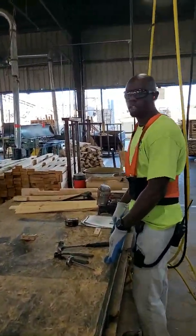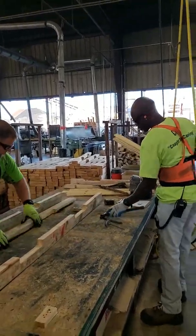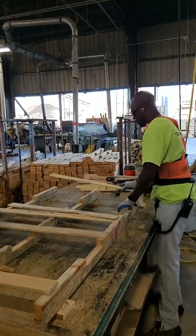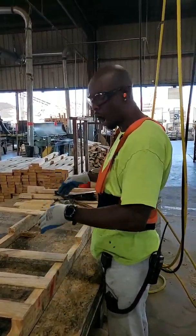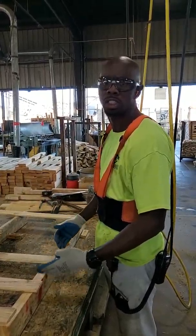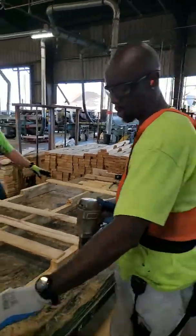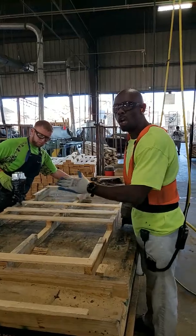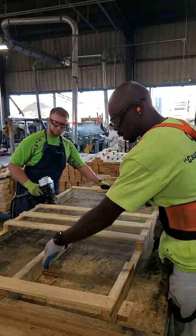Carter is grabbing three runners to start building the bottom. If your bottom is not straight, then the top is not going to be straight. So you want to make sure all your boards are flushed and lined up, and that the pallet is square. We're going to start off by building corner to corner, which squares up the pallet so it's straight and not crooked. Always wait before you shoot the middle to make sure all your boards are lined up and flushed, and that the middle board is touching the blocks in the middle.